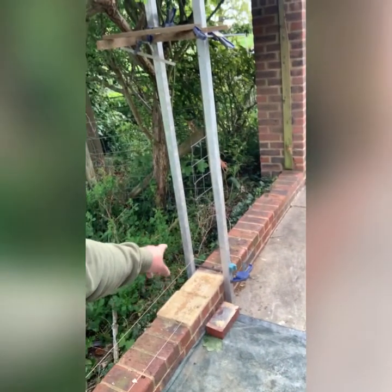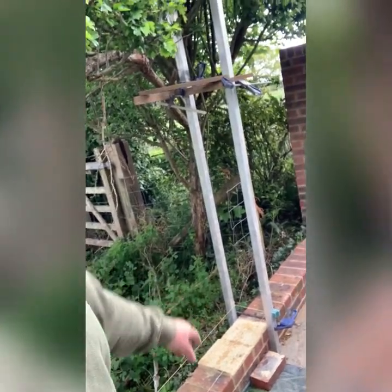We're going to shoot off now, go pick up all the bricks for the piers, the sand, and the cement. We're going to be drilling into the base — obviously I've got to get the rest of this mortar off — and then we're going to be drilling down using epoxy resin and putting some reinforced steel bars upright, just to try and prevent this from happening again. It's only one brick deep, two bricks wide — they really aren't ample enough for six-foot fence panels between them. But we can put some steel rods down through the middle and hopefully that'll give it enough strength.